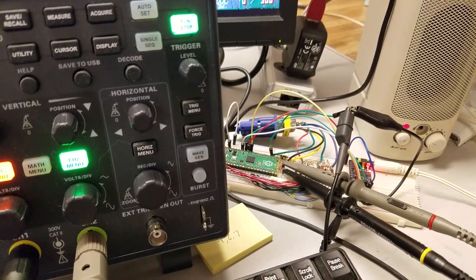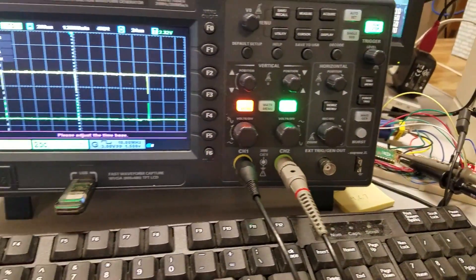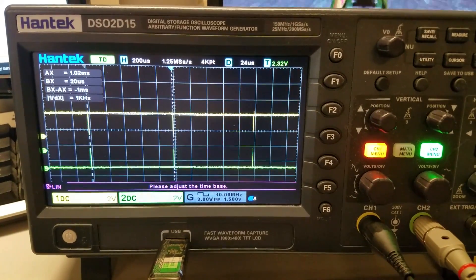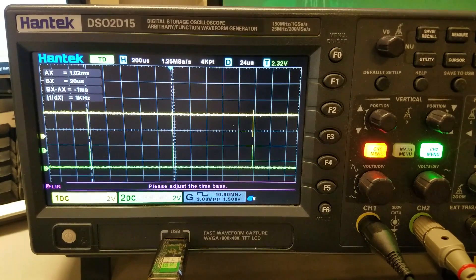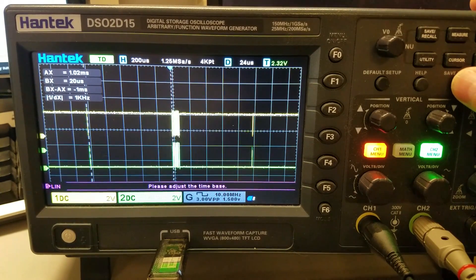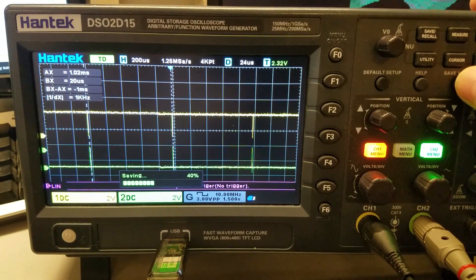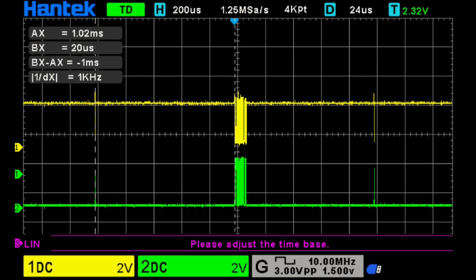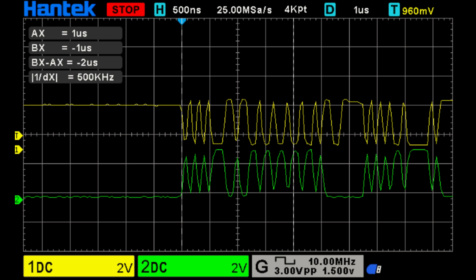I took the opportunity to look at the USB waveforms. I connected my scope to the D+ and D− lines I brought out earlier. USB uses differential signals to convey packets of information. Ben Eater has an excellent video about interfacing a USB keyboard — I'll put a link in the description below. For this setup, the host queries the network about every one millisecond. However, most of the time it just sends a NAK, or negative acknowledgement, meaning that the host isn't ready to accept data. I assume that's because Doom queries the keyboard much slower than once per millisecond.